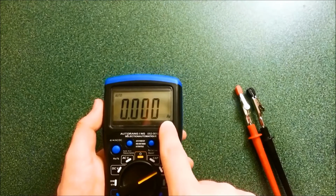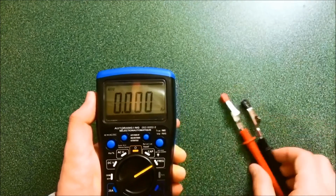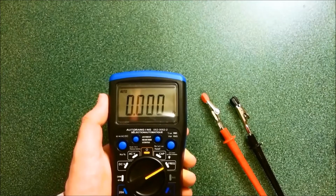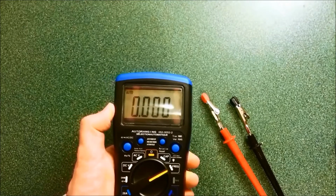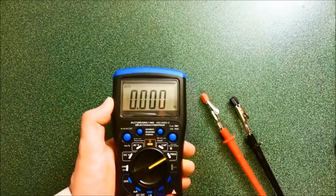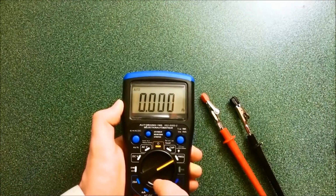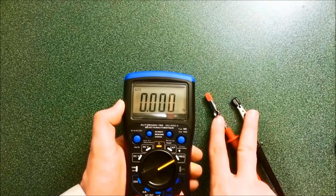So yeah, this actually shows hertz, and one of the interesting things with the generator project was that when we hooked this up to the outputs from the generator, we were able to get the cycles per second coming off of it, so we were able to do the back calculation and figure out the rotational speed necessary to generate different voltages. And we did use the cheaper multimeter to read the voltage as we were pulling the frequency, and I definitely would have wished I had two of these for that project and another set of these, because these are handy even with two people.